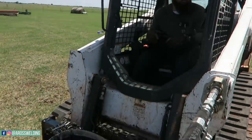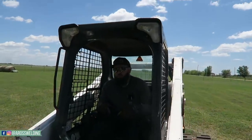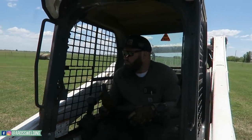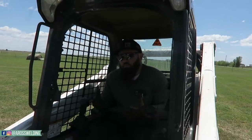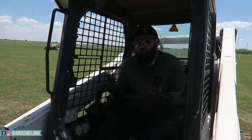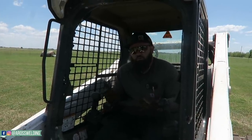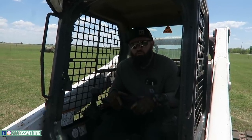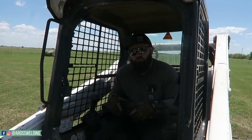We're fixing to pop some holes — we're going to try to go at least four foot, right Mitchell? Yes, we're going to go about four foot give or take. You don't per se need to go four feet, but if you're going to have drop instead of making that extra cut, I like to put it in the hole because any leftover pipe you might as well use to ridge up that fence instead of wasting it. And it's not going to take any longer to drill a few more inches.